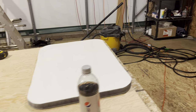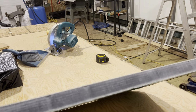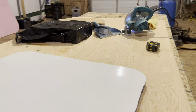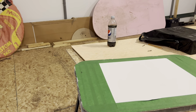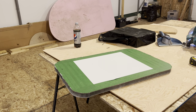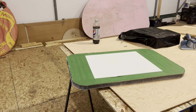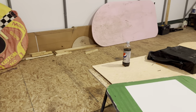It makes a much stronger lamination. And if you haven't watched any of my other videos, this is basically the material that gets created for the trailer. This is a window cut out. It's very strong and very lightweight — works out to approximately 1.25 pounds per square foot. Which at first you might think that's very heavy, but the body on the last camper that I built only worked out to 188 pounds for a 4x8 teardrop shape like that piece of foam you see over there.